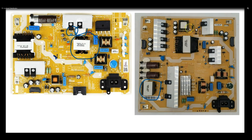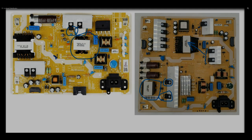Here, of course, is our switching transformer because the pins are separated between the line, with the isolation line. But as you can see, here is our PFC diode and our PFC switching MOSFET, right? And these obviously right here are the FETs for the main switching transformer right here. Okay, these are the FETs here. Okay, so this is our PFC circuit here and here.